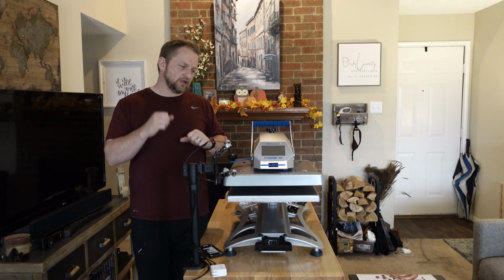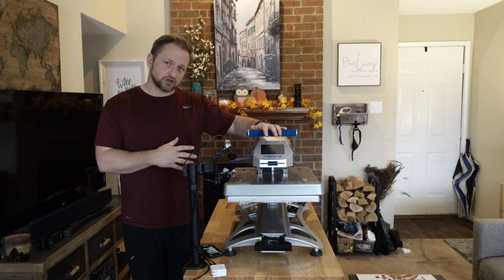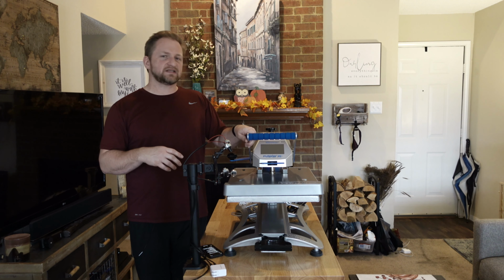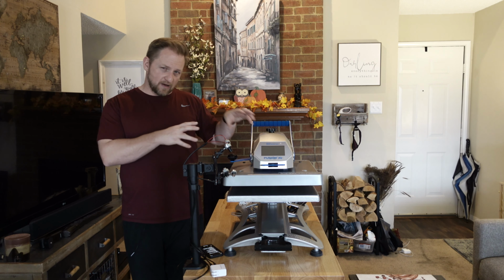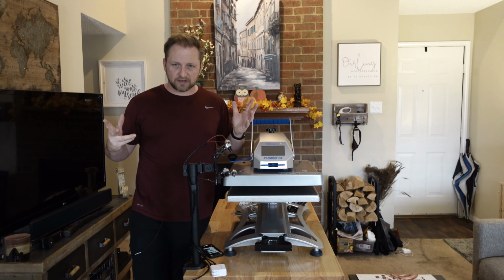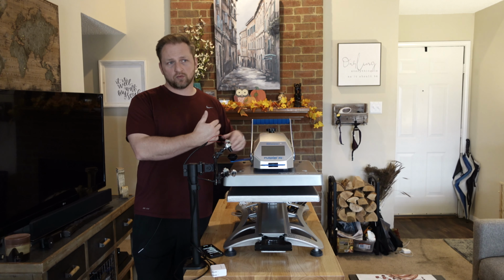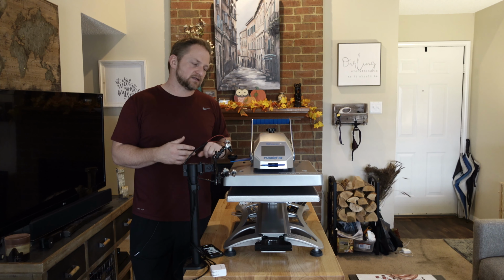It's very, very random, and usually I notice it after a pre-press, because you need a certain level of pressure to initiate the press procedure, because once it's initiated, that's when it knows to start the timer. And when there's been a hiccup in the timing, I've noticed it when I haven't locked the pre-press down. So locking the pre-press down seems to keep that from being an issue. Again, it's random, but if you're changing things out, like on goof proof, I don't want to run it 4, I want to run it 6 seconds.